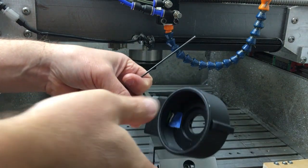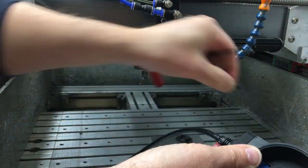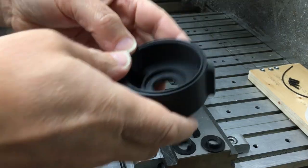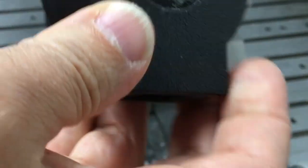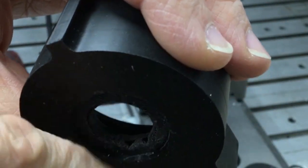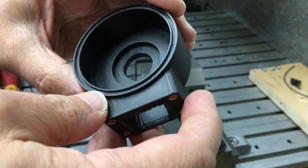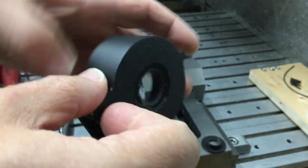I did have it installed but it's not working, so we'll strip it back down and figure out what's happened. Long story short, for some reason this didn't work. It was really temperamental, the signal wasn't very good at all. So what I ended up doing is just filing where the infrared send and receive come out, just to try and get the LEDs a bit closer to the reflective surface. But for whatever reason, this very minor design change has caused it just not quite to trigger very reliably.